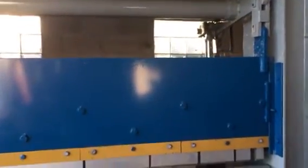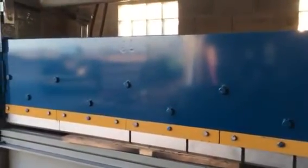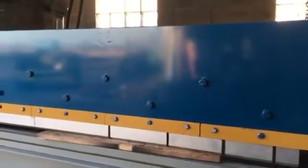The main die holder here at the top — the blue part — is one inch thick. It's actually two pieces of one-inch-thick material. See if I can go down the side here. There's a half-inch piece sandwiched in between to give it the space for the tang on the die to slip up into. It's plug-welded together and welded across the top, and then there are ten one-inch diameter bolts squeezing the whole works together.